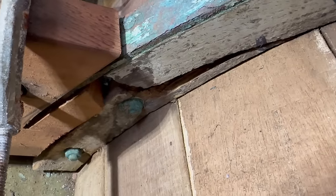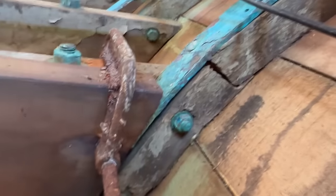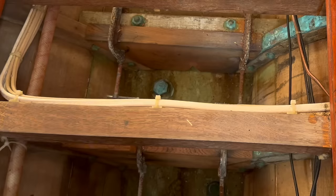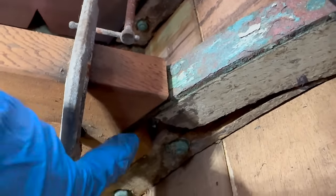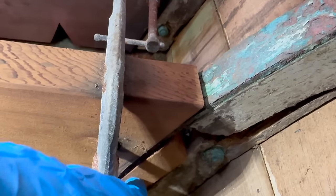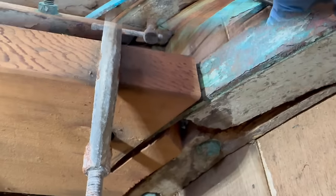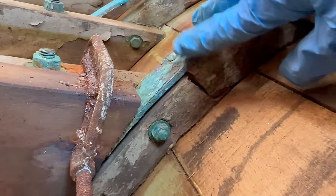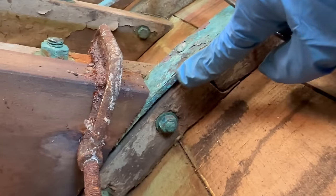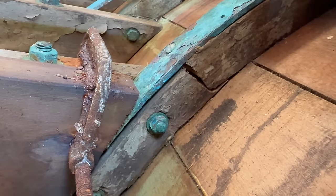Welcome to the bilge. There's a cracked frame. That's a bilge pump. So I've sistered in a couple of stringers here - I see at least two, three cracked frames. It's also been very carefully sistered in with this bronze strapping. There's a special relief cutout to fit in the strapping to hold that in. It's not supported by anything but this, and you can see it's giving away, distorted, from the force of that cracked frame. That'll have to be addressed.